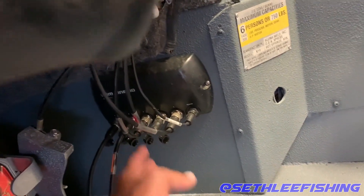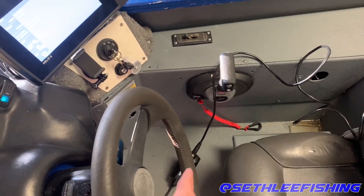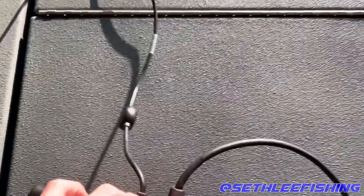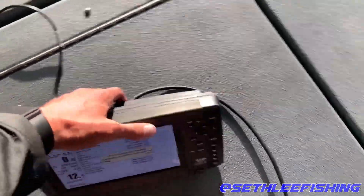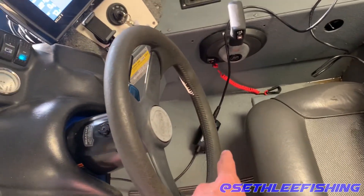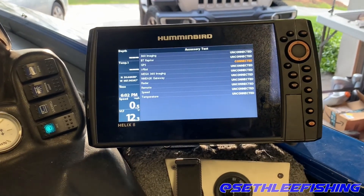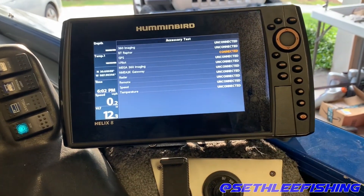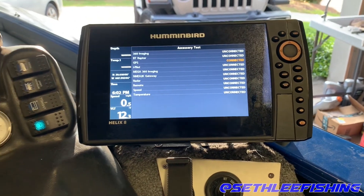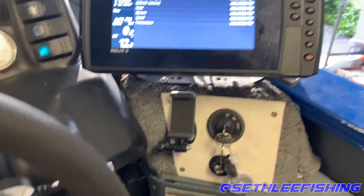I have all of my units connected to the other ports on the switch. But if you want to run engine data to just one unit — for the 900 series — you actually have an Ethernet port straight on the back, so you can plug that box directly into the back of your unit. But if you have a Helix, you're going to have to have the Ethernet adapter; I'll put the link below. If you already have units networked, you most likely already have that box, so you don't have to worry about all that.